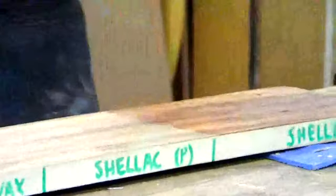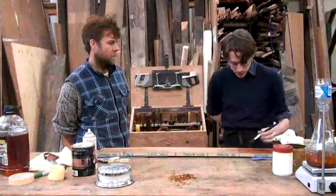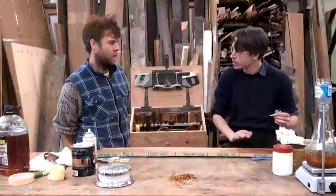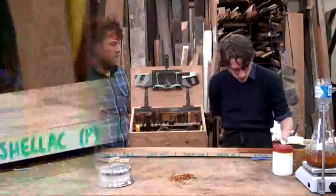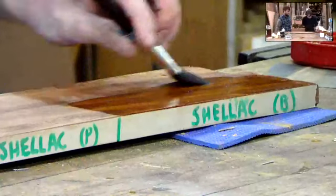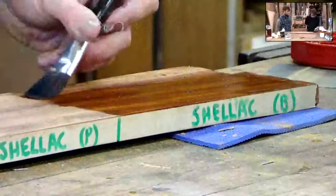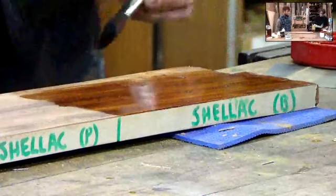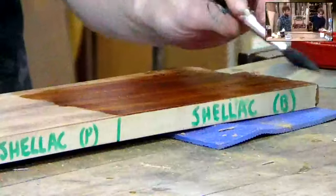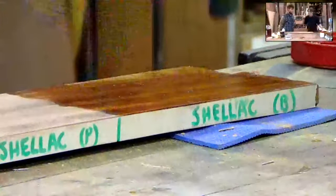And that's brushing with shellac, and that's really it. I'll do another coat here. Now that it's pretty dry at this point, I can come back and just do another coat of that. I'm starting this way. Often I would actually work across and off the other end, but because I've got a hard line and I'm going off this end, you always work off the end. If I was to run on that edge, what you'll see is I'll get a drip running down.